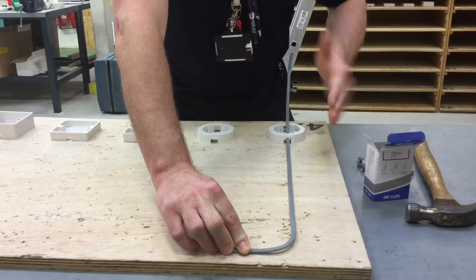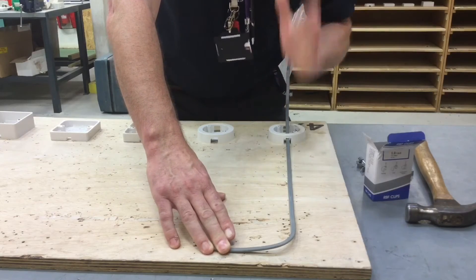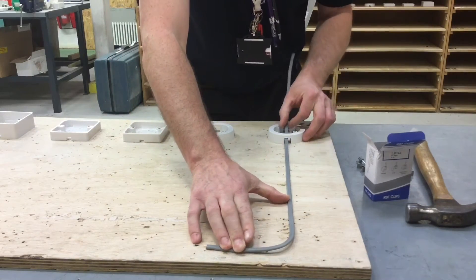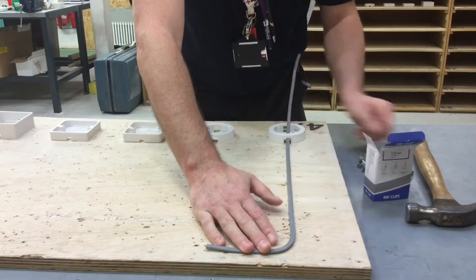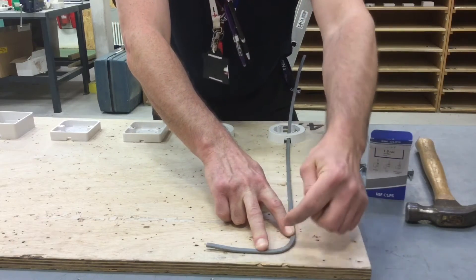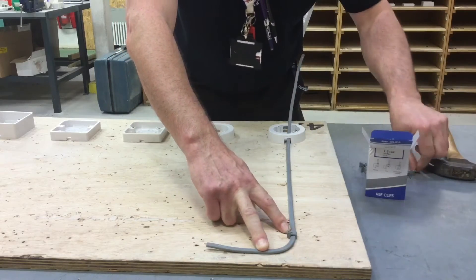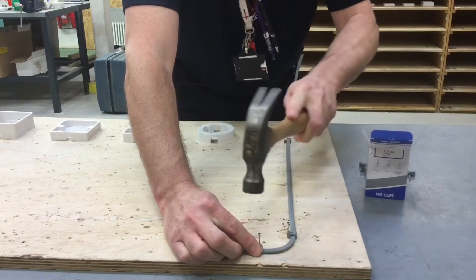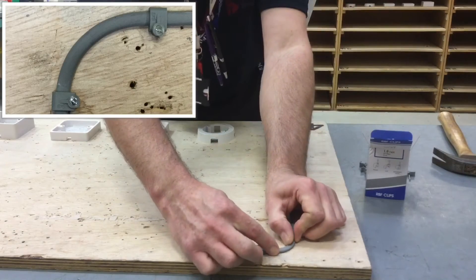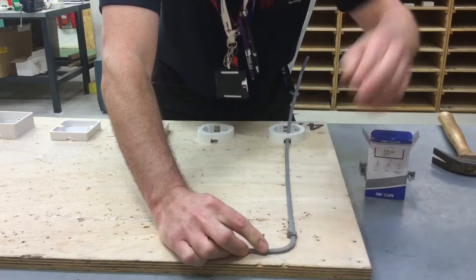My cable is now into the accessory. I've got a smooth 90-degree bend on it and I'm trying to get it straight into my accessory. In order to make some adjustments, I'm not going to fully put my clips in just yet — I'm just going to pin them into position. The clips are PVC, one millimetre squared clips, and they're grey the same as the cable itself. I like my clips to support across the bend — not actually on the bend — but the first straight point either side of the bend would be my clipping position. I also like my nails to run in the appropriate order. Just pin it into position so I can make adjustments if needed. Equal distance across the bend on the other side — if I were to split the middle of that bend, the clip would be even distance each way.